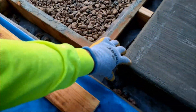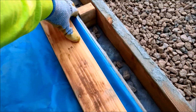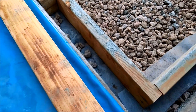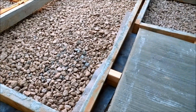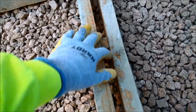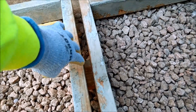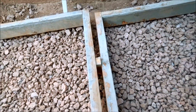Since I want a four-inch gap and this is one and a half inches, I just have to put the appropriate wedge to give me four inches around the form. When you have concrete on wood that's the case, but when you have wood on wood or frame on frame you need a much smaller piece. So just make sure you get your measurements and get the right size wedge for the appropriate spacing.